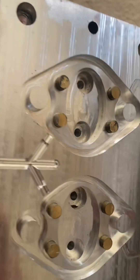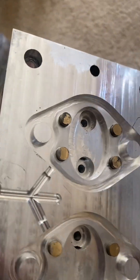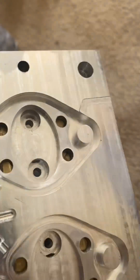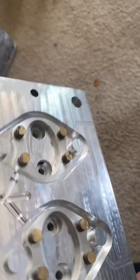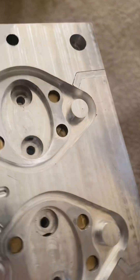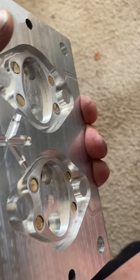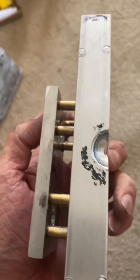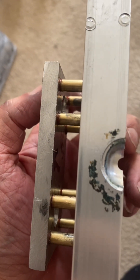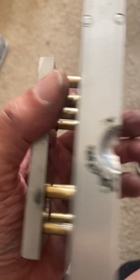Here's one of my molds that I use, and these are the ejector pins sticking out — those brass ones right there. In order to get those made right, you have to mill them after you've made the push bar. You have the push bar in the back with the ejector pins all screwed into it, so I put threads on those and tap them in with Loctite.